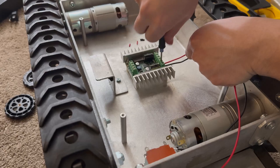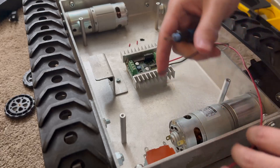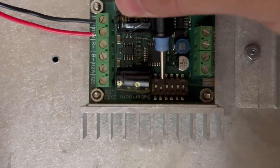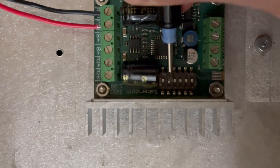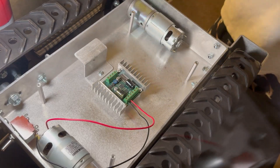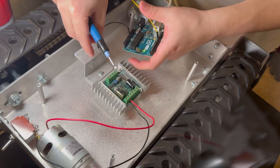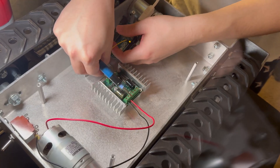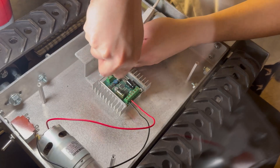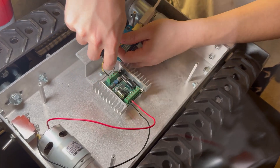This dual motor controller supports two motors — there are two sets of terminals. It can take from 12 volts to 50 volts of power. The motor controller is called the Sabertooth dual motor controller and has several settings. It takes a TTL signal from Arduino, so you can send numbers from 0 to 127 to control how fast the motor spins and also set the direction — forward, backward, and combinations of that.